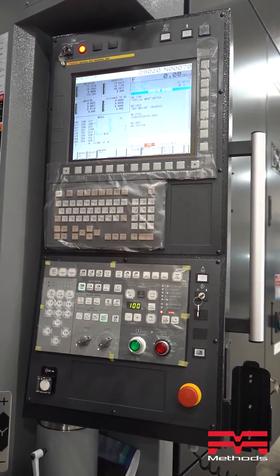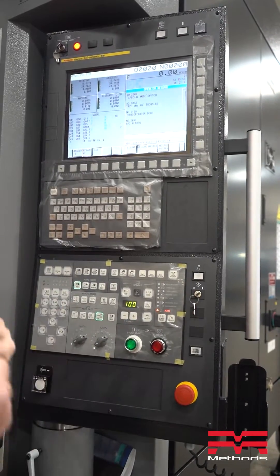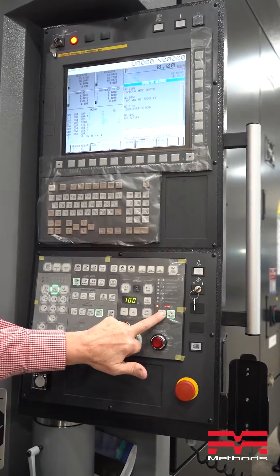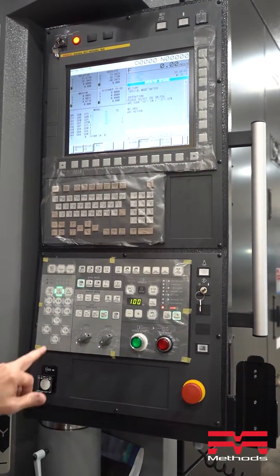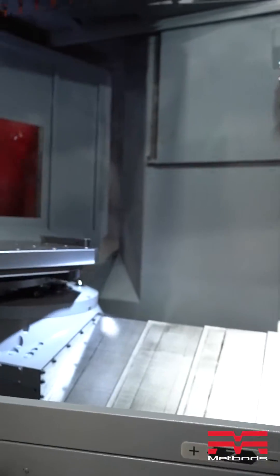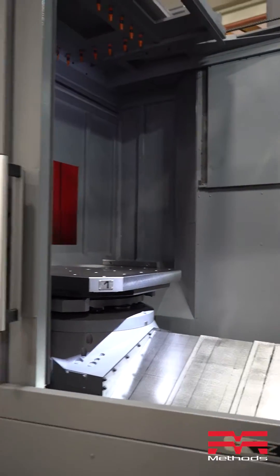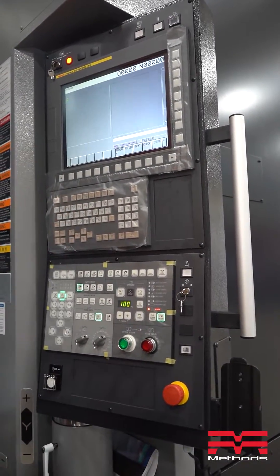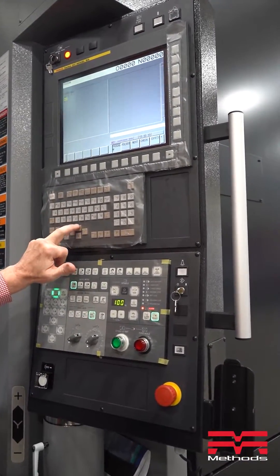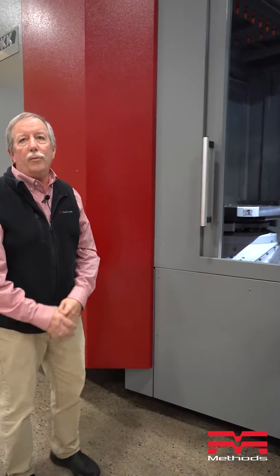That's the number input, and then from here we go down and turn our NC control power back on, get our hydraulics up. We reset our alarm, and at this point it tells us to hit either one of the x-axis buttons, which we do. If you focus over here, the machine is now recuperating — turning, clamping, and resetting. At this point, if everything looks good, he goes back to his main program, cursors back up to whatever line he wanted — back to the safe line — and then we hit cycle start and the pallet changer will continue on its way.